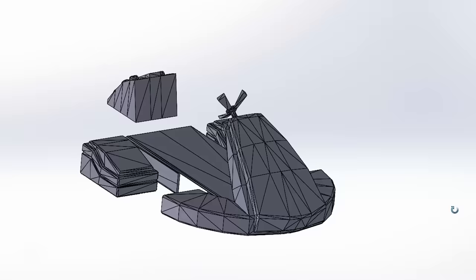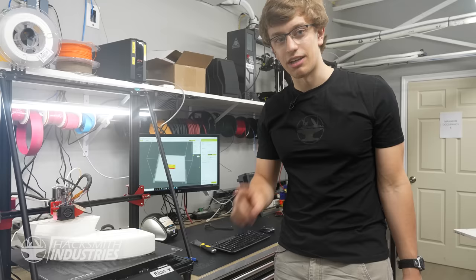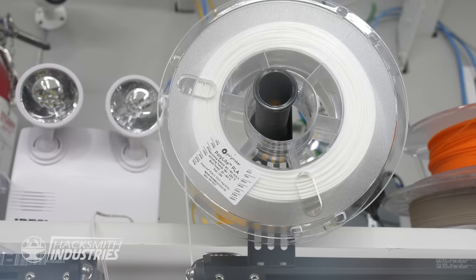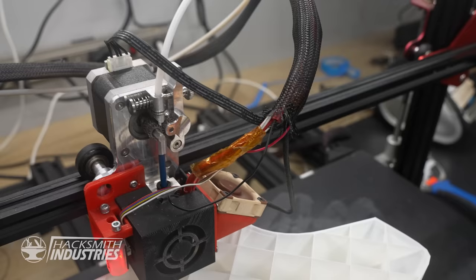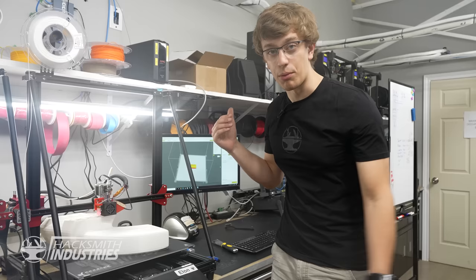We start by taking our 3D model and importing it into a piece of software called a slicer. That slicer takes our 3D model and decomposes it into a bunch of short instructions that this robot right here, called the 3D printer, can follow. The machine follows those instructions and takes this filament, which is a thin strand of plastic. As the filament is extruded through the nozzle, it gets pushed into layers upon layers upon layers, 0.2 millimeters at a time in this case. And as those slowly accumulate, it builds up the entire model that we put into the slicer in the first place.